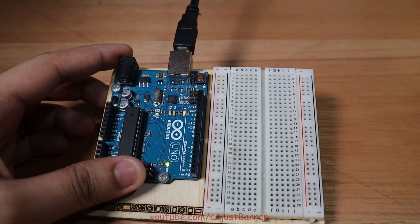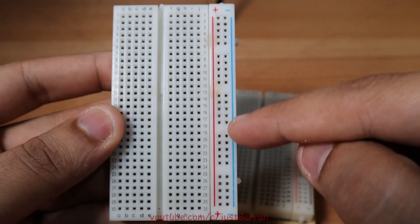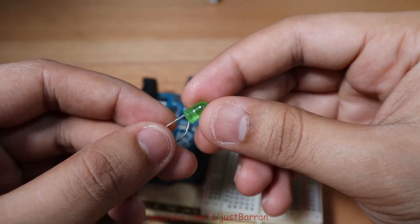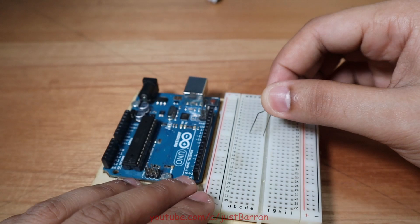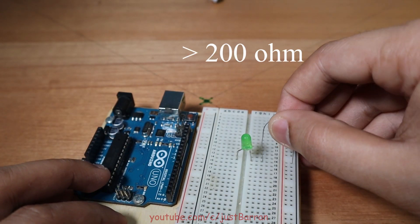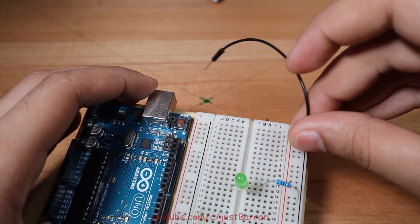Now it's time we move this off the Arduino. We'll use a breadboard to easily make temporary circuits. A breadboard uses small contacts under the board to electrically connect holes above. Each row has a connection between its five columns. On each side there are power rails with positive and negative columns, each having their own contact running down the length of the breadboard. Disconnect the USB from the Arduino as a precaution — as we say in engineering, we want to keep the smoke inside the microcontroller. Take an LED and find the anode, the positive leg, which is the longer leg. Place it on the breadboard facing the Arduino, putting the other leg in a different row. Make sure they are in separate rows or across the valley. Now add a resistor to protect the LED and the Arduino from high currents. We can use a resistor above 200 ohms to safely protect the LED, though the higher we go the less visible the LED becomes. Connect the resistor between the cathode and a ground rail, then connect the ground rail to the ground of the Arduino.